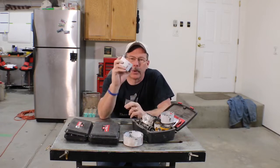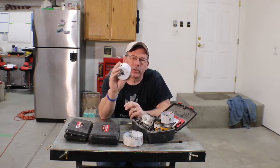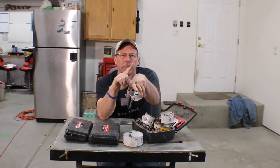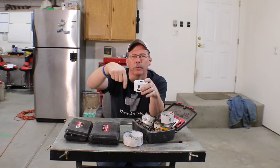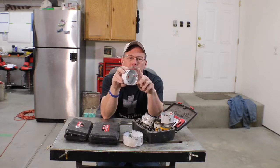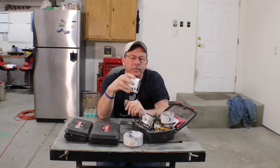The problem with a hole saw is — even if you buy the really expensive ones, and the Milwaukee are getting up there — you get a pretty good hole, but they're not usually well-balanced and they're not truly round. The teeth are staggered: one tooth is pointed outside the hole and the next tooth is pointed inside the hole, all the way around the diameter. That's to help clear the chips as it's cutting, but it also makes the hole saw wobble a little bit and tends to make the hole not round.